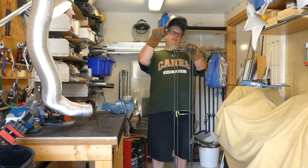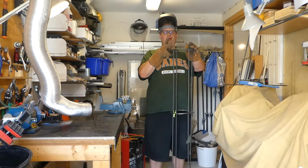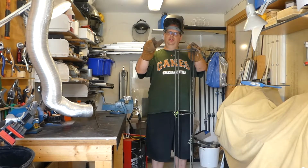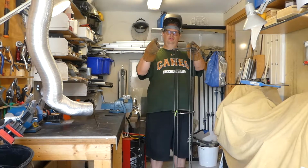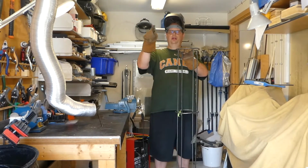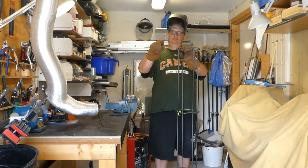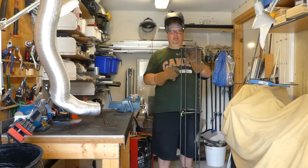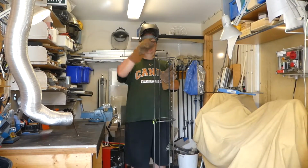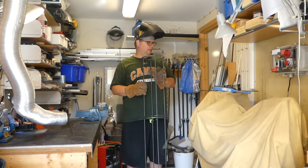I haven't decided yet. I start to bend one circle that is 40 centimeters in diameter, 400 millimeters. I haven't decided if I should bend it up like this and then make a round edge and go straight up, so I have two circles, 400 millimeters. Or I should make it like a half ball or square, and then make it 400 millimeters, and then I need to measure it when I weld it together, what the diameter is down here, and make a new circle. So I think about how to do that after I make the first circle and see how it might look. So this is ready, so I need to put that aside so I have more space.